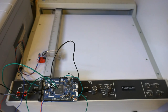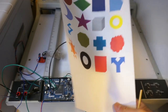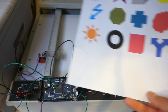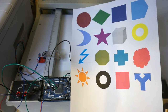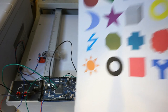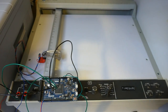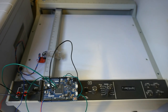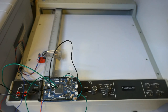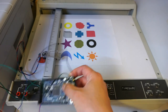Speaking of the image, I just printed out this one. I have different shapes and different colors so that we can gauge how well the single pixel scanner works. And I'm going to use an external power source to power the Arduino, so that the DAC output would be less susceptible to noise coming from the computer USB due to activities on the computer.